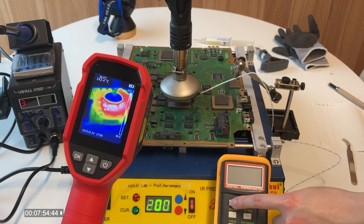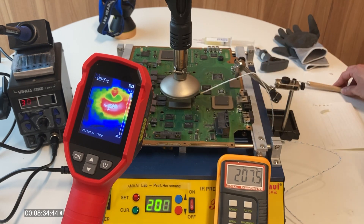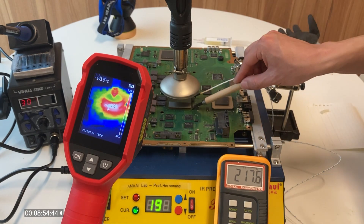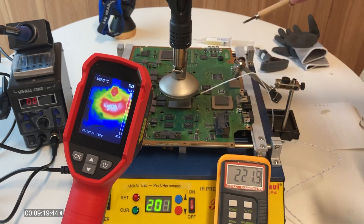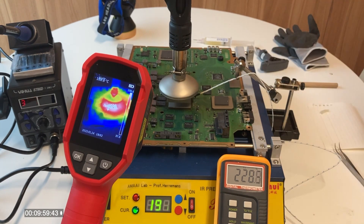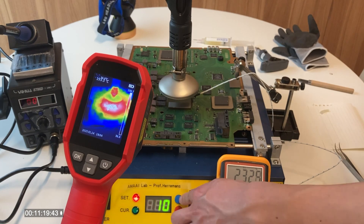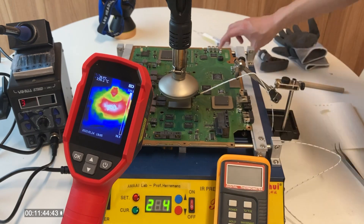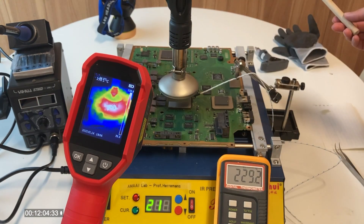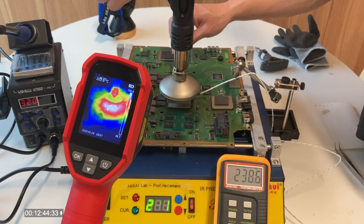I turned on the hot air and the cell processor temperature continued to rise. The thermocouple reading is close to 200, but the infrared camera shows only about 170. I think the thermocouple is also measuring the air temperature around the processor, so the actual processor temperature is less than this value. I was struggling to adjust the nozzle position — it keeps bouncing up because I am using a very cheap setup. I have been nudging the processor from time to time to see if it is ready to be removed. The motherboard temperature isn't increasing anymore, so I tune up the preheater temperature and add a little more flux. The cell processor isn't moving at all, so I tune up the hot air temperature and try to bring the nozzle slightly closer, but the holder simply refuses to cooperate.